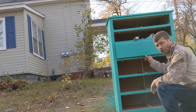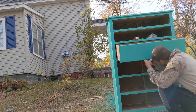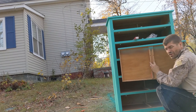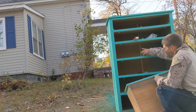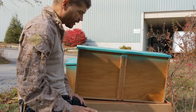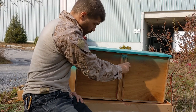So this is the way the drawers used to work — you'd open them up but they would fall down like this. The reason for that is underneath them they have this railing. Well, this rail is all chipped and broken off here, so it's no longer grabbing the rail. So the way we're going to repair this — one of the problems is this rail, when I put it on, it's not going to necessarily fit because I'm putting new slides on. So what I'm going to do is remove all of these slides.